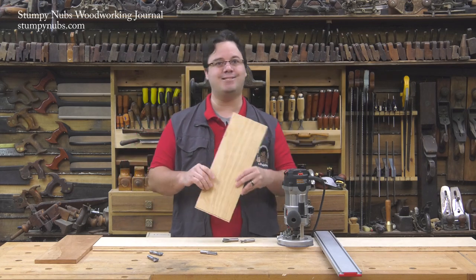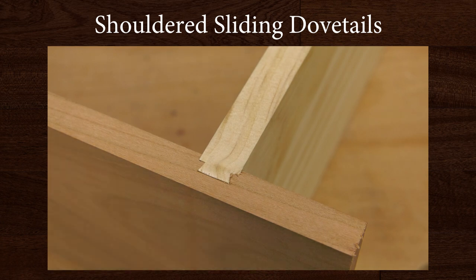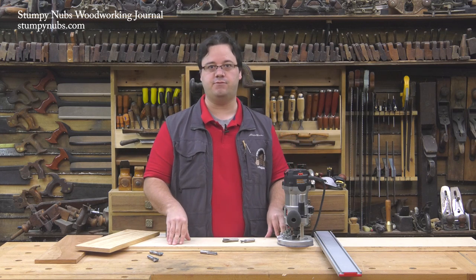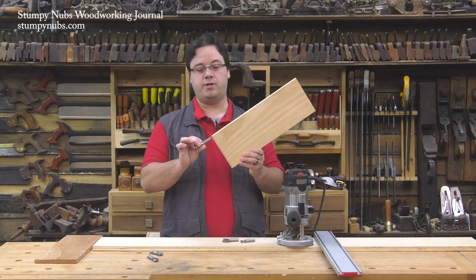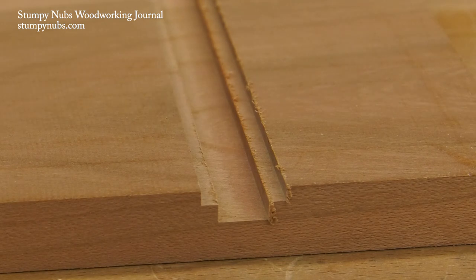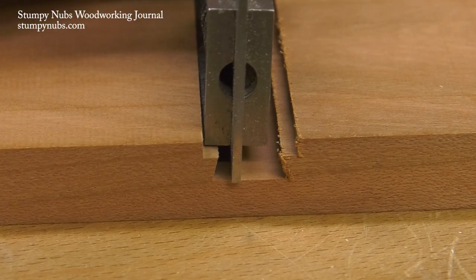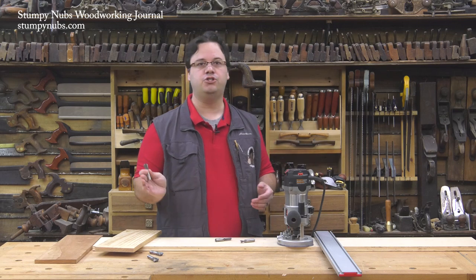A tapered sliding dovetail is properly fit when it slides together easily right up to the last half inch or so, which can be seated with a light mallet tap or two. Traditionally, a lot of sliding dovetails were shouldered, giving them a more complex look, but a shouldered sliding dovetail is well within the grasp of anyone who's mastered the standard version. You'll first cut a dado with a straight router bit the same thickness as the workpiece that will have the dovetail tongue — about an eighth inch deep. Then, without moving your edge guide, use the same two-step process to cut the dovetail socket in the bottom of that dado: first with the narrower straight bit, then with the dovetail bit. Don't go deeper than about two-thirds the thickness of your workpiece. When transferring the depth to the router table, measure from the shoulder of the dado, not from the face of the workpiece — that's the height you must set your dovetail bit. Then mill the tongue just as before.